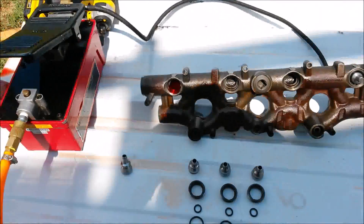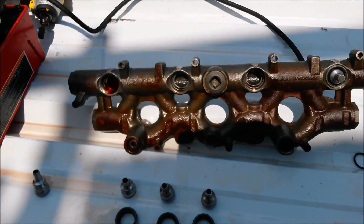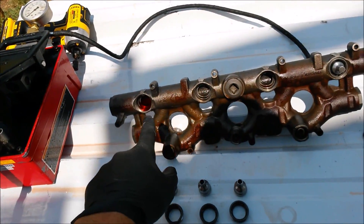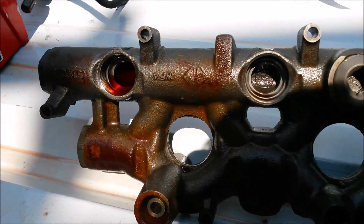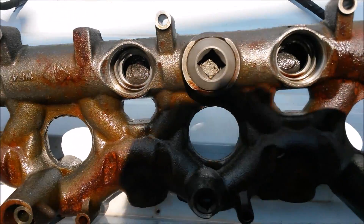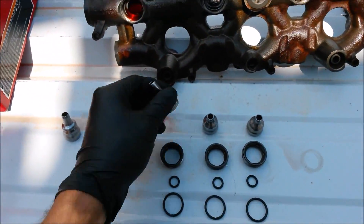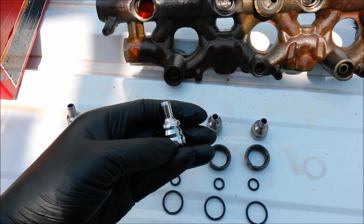What we've got set up here is an oil rail off a late-model 6-liter diesel and a 10,000 psi hydraulic pump. We're actually powering it with transmission fluid so you can see the nice red color — and transmission fluid is actually much less viscous so it should leak out a lot better. We're going to go ahead and put in one of our nipple cups; we've got them all plugged up on the bottom so they can't leak out the top.